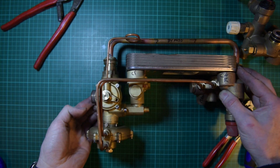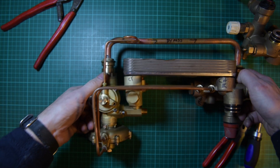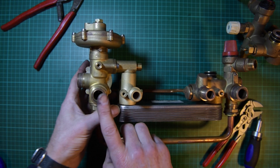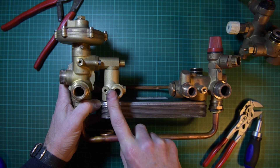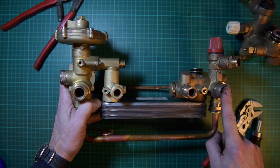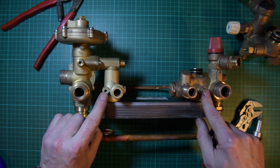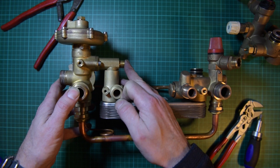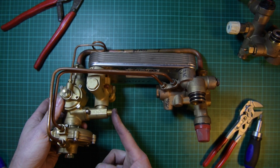There is the flow that would come down from the main heat exchanger to here. If I flip this over — flow to the radiators, and typically this would have isolation here, open here going off to hot water taps. This is your cold mains coming in. This is the return — the return for the central heating. These two positions here are anchors onto the chassis of the boiler. Pressure gauge.